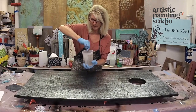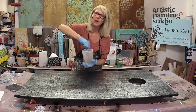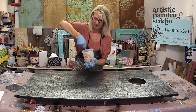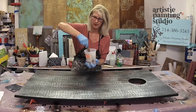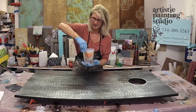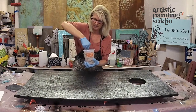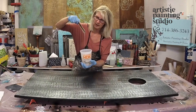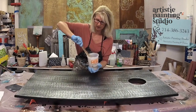So when you are mixing up your epoxy, again, this is the Stone Coat countertop epoxy that I'm working with, you want to mix it for at least 2 minutes, and I was mixing it with a drill. I have a mixing bit for my drill and mixed it for 2 minutes, and now I'm just making sure that all my sides are scraped and the bottom is scraped and all of that beautiful diamond dust is all mixed in there. Okay, and we are just going to go ahead and pour this